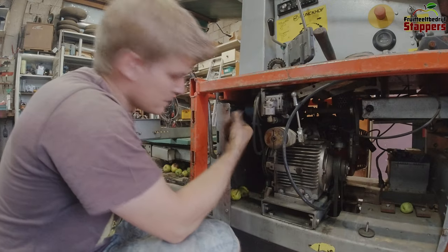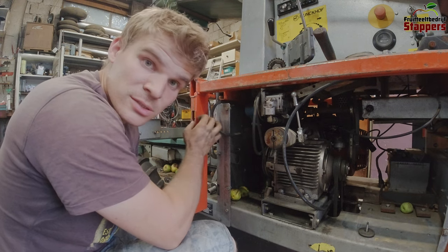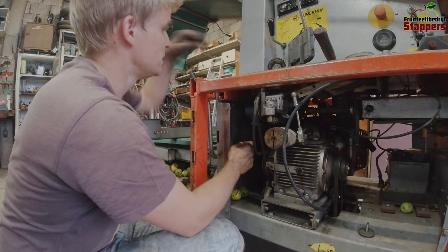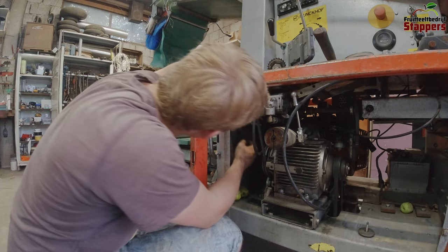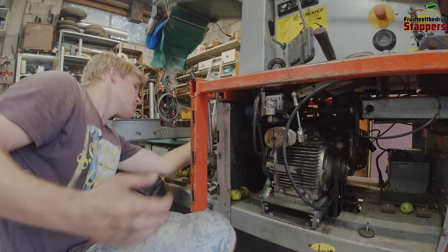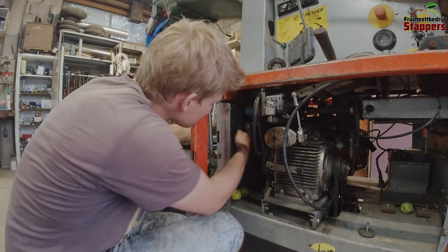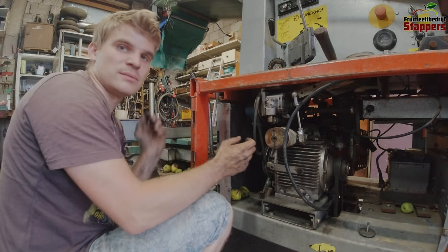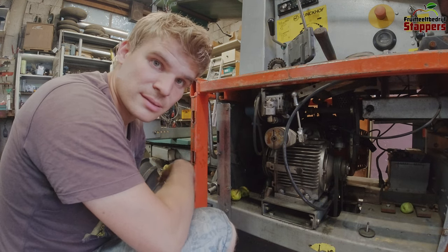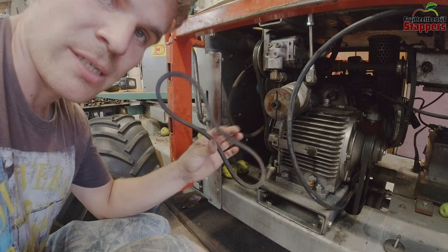We have a new belt here. It's a bin table belt — it's also worn, so we're going to take it out and put a new one in. To do so, we need to demount two bolts on top and also mount bolts on the rear which are holding a bearing in place. Then we should be able to get the v-belt out, put a new v-belt in, and it should be good again.